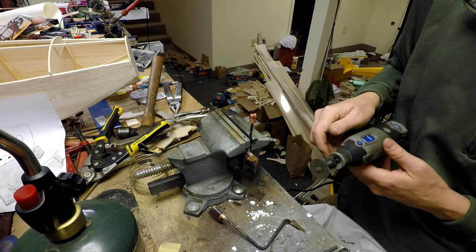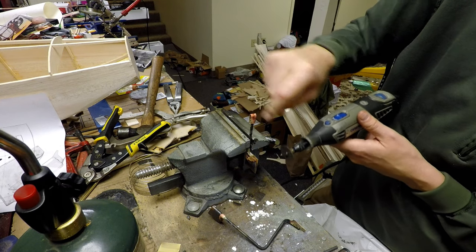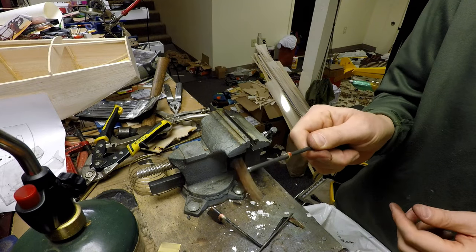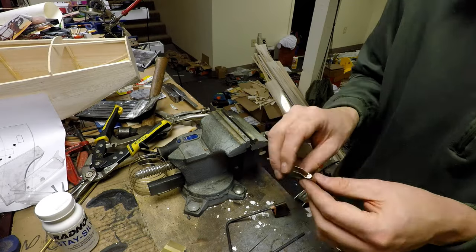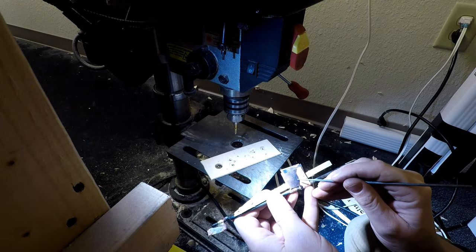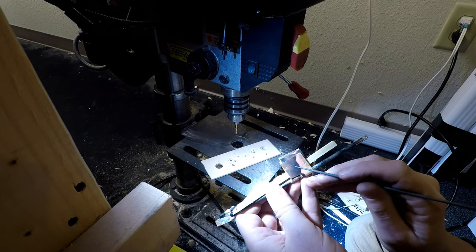While the upper arm is cooling off, I start cutting on the lower arm, beginning with the bottom end. This piece needs to be trimmed down to be the same width as the wire. Then I trim away just the curved portion of the larger brass piece that is past the end of the steel — do not cut away any of the steel. What I want is for the upper and lower support arms to fit together with the two steel rods perpendicular, ends touching, and centered on each other.